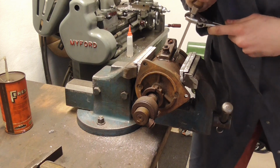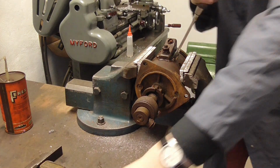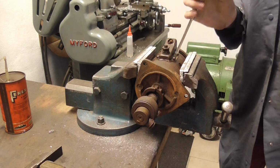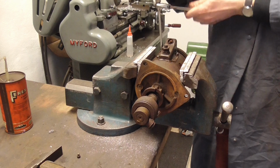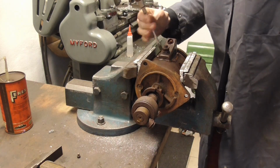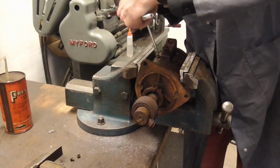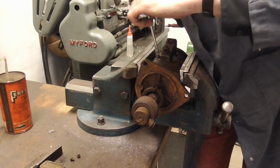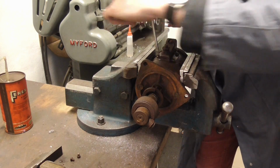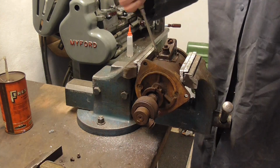Now I'm leaning on here with my full body weight. And then, look, the screw is already coming out. Rather be careful, rather than have this thing stuck in here, break off, and get wrecked. Now if these were still stubborn to get out here, another trick is to go back and forth, that loosens any rust off too.